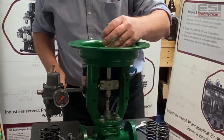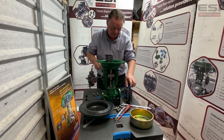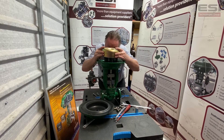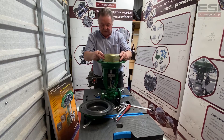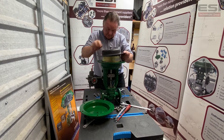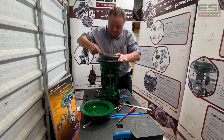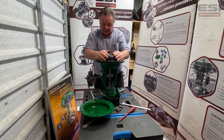Next I place the springs on the plate equally all around. I put the plate upside down, making sure all the springs are settled in — this can be a bit fiddly. Once the springs are back in place, we have a collar in here, and then we place a bolt down through the centre, through the plate and through the collar, and directly onto the stem. The bolt is now tightened down with everything in place.